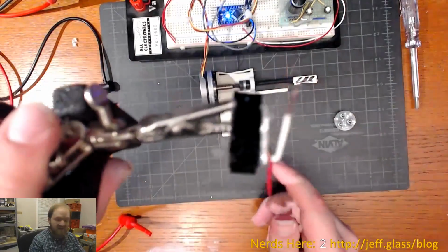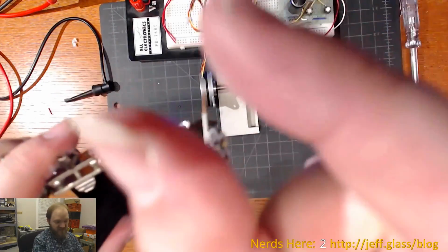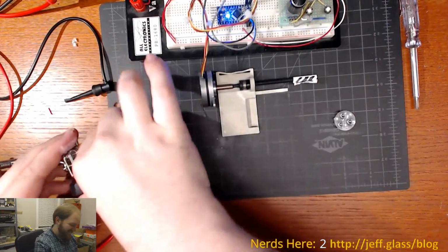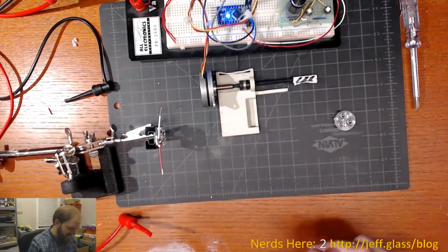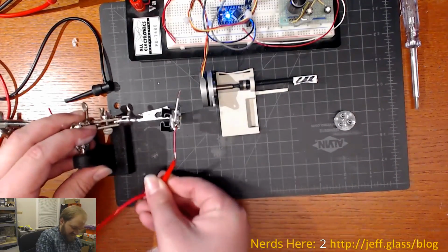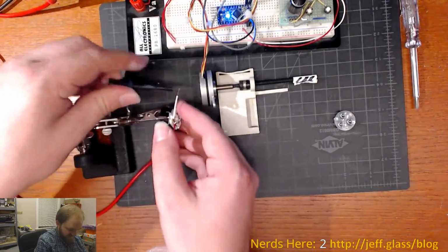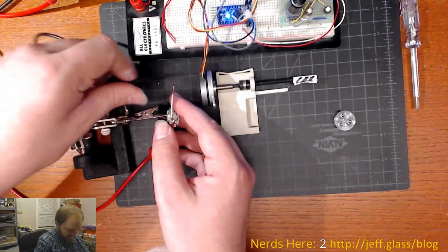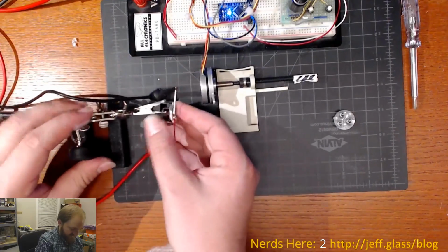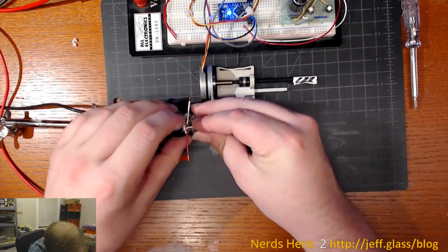I've been running the chips inside the PLA lights themselves at about 1 amp, and they've been fine with just a little tiny, I think an original one was a Raspberry Pi style miniature heatsink, but just so I don't fry anything too early tonight, I got this on a little tiny heatsink of its own, and I'm going to use the pressure of these little clip leads to help hold this against the heatsink. It's just stuck on there with a little bit of heatsink adhesive, and then we'll put the lens back on the front of that.